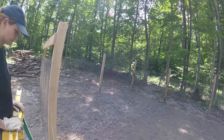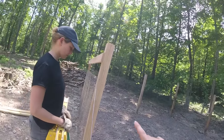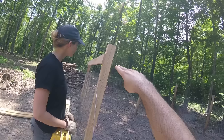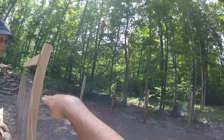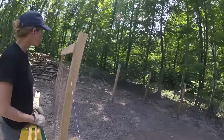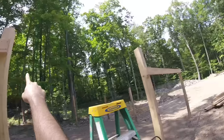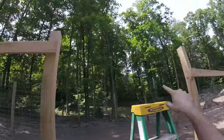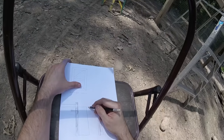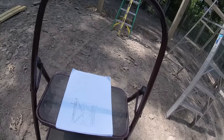So that's six and three-quarters. We'll make the door six and three-quarters — we're actually going to use that top board as the height of the door. We'll make it six and three-quarters below the top of that board, and then when we get over here we'll be about six and three-quarters above this board. So basically I'm just going to make the door flush with the bottom edge of that board, and then the top point will be halfway down to the top point of that board over there.